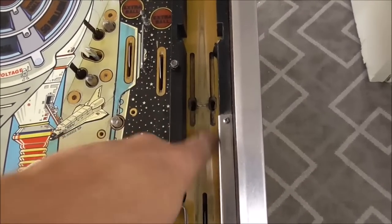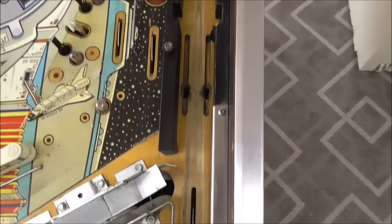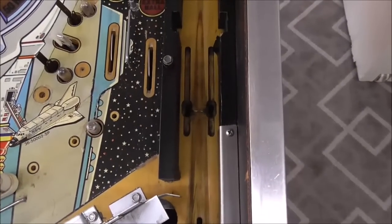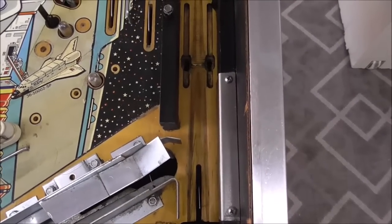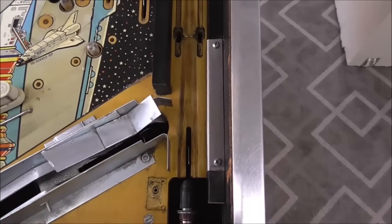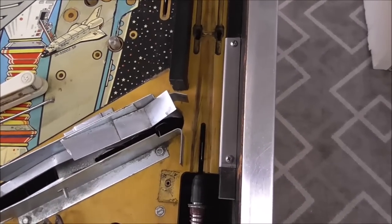If you're painting on bare wood, you can't really wipe it all the way off. So we'll throw a little clear on it and see what it looks like after that. All right, so that's how it looks so far. Much more even. The clear coat darkened it up a little bit. I wish it didn't have the darkened areas, but it just does that.